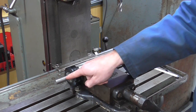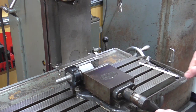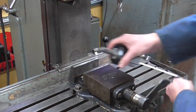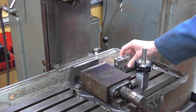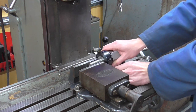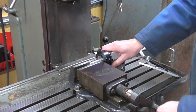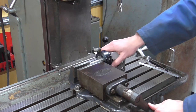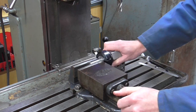As you can see though, I'm going to have a lot sticking out and I don't really like milling with as little support as that, so I'm going to do a bit of reverse psychology on it. Instead of hanging on to the collet block, I'm going to take a 1-2-3 block, sit that on the bed, and use that to index and reference the collet block. So now I can actually hang on to the material I'm cutting by means of two line contacts down the diameter, and as I want to index I just rotate.